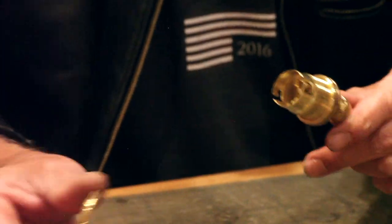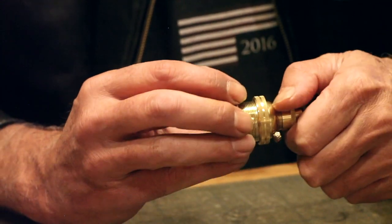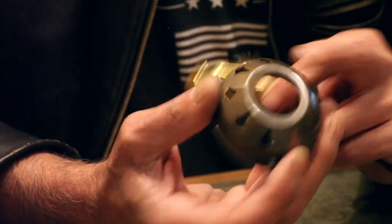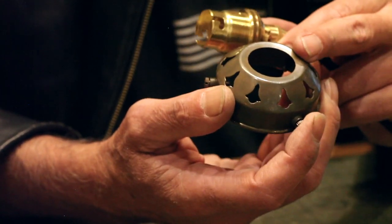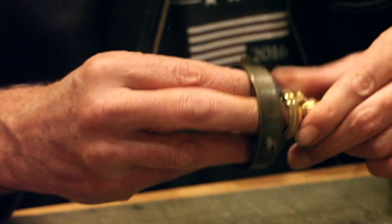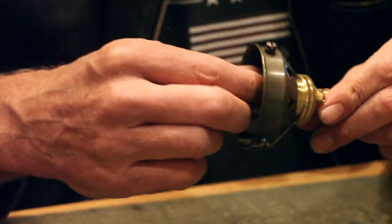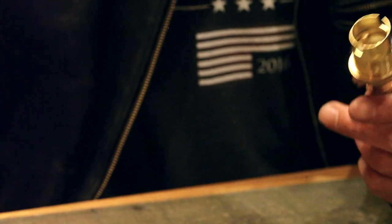Normally if this is just a bare bulb fitting we could leave it like this, or we could put the shade ring on and leave it there in case it's needed. In this case I'll show you how we put on a gallery. The gallery is a special size — this one is antique brass — with a 28mm hole, which we have for sale to fit exactly these lamp holders. These only need the single shade ring that comes with them. As long as you've got a 28mm hole in whatever you're attaching to, the shade ring will work.